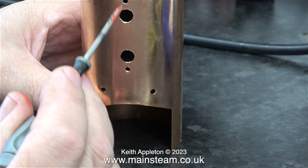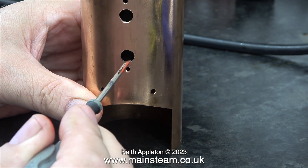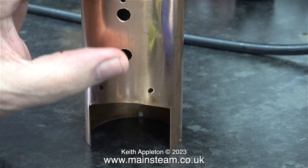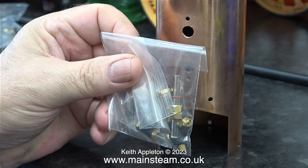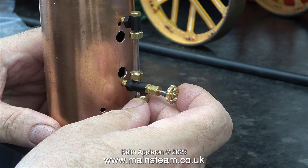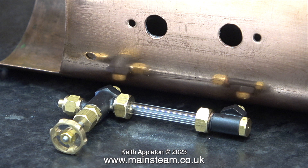These holes are going to be redundant, but once I dismantle the boiler I could silver-solder a flat plate over all of these holes. That is because I want to fit a proper water gauge — a small water gauge with a 3/16x40 thread that would go into the plate on the front of the boiler. But all this really depends on what I see when I dismantle the boiler. I could easily make a new cap, a new tube plate, and even a new inner tube, or just make a new boiler, copy the design, but silver-solder all the parts.